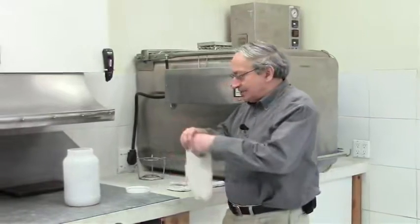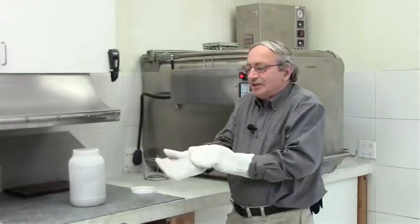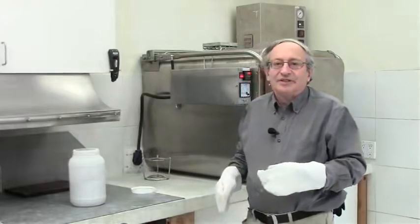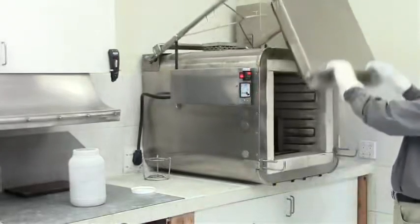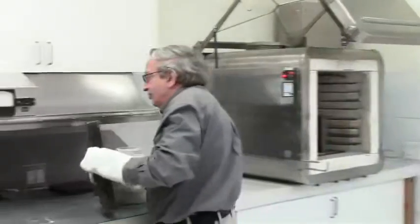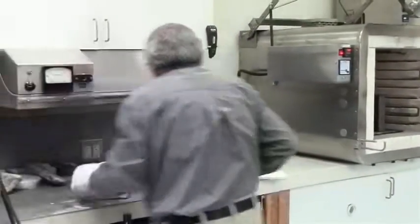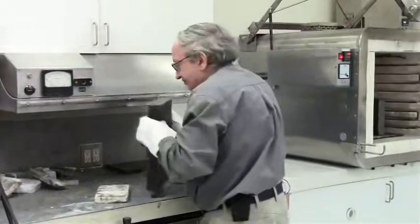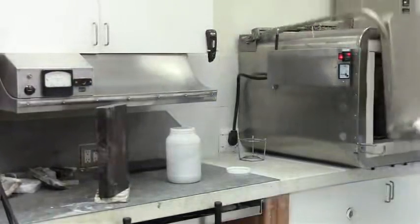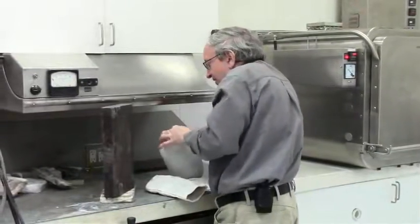So what you do is you heat up the part to about 230 degrees C, the same temperature as for painting, and while the part is hot, you just sprinkle some powder from the same powder you use for painting into the defects. The paint will melt and fill the defects. So let's do that. I have two boxes here which had to be welded. Actually, we put them on an insulator so they stay hot longer. And close the oven.